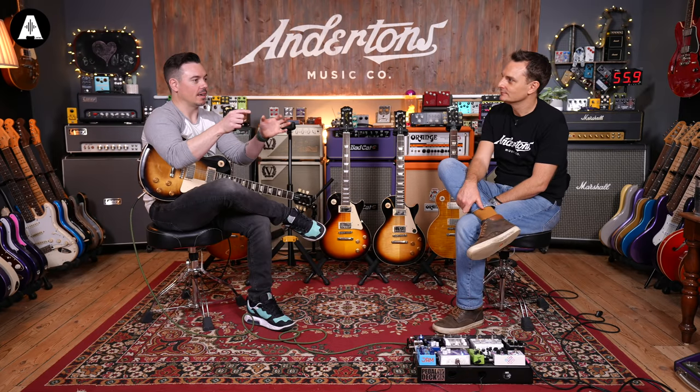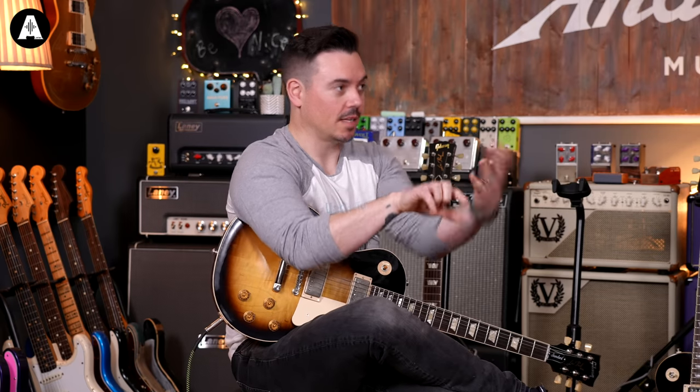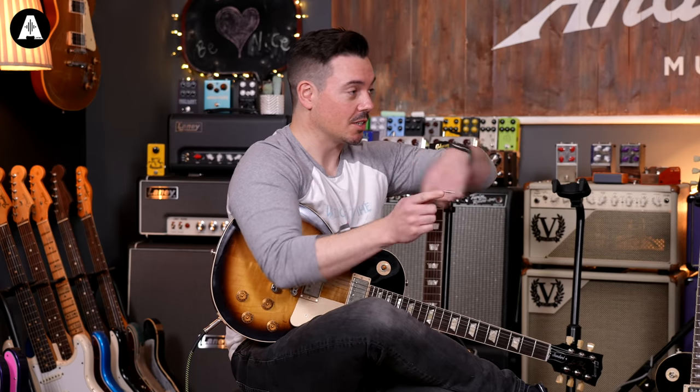So positions two and four on a Strat are reverse wound, reverse polarity. What that's doing is literally flipping phase, so technically from that point of view, it is out of phase. But you also have the magnetic polarity flipped. So if you flip the wind direction, your signal goes from this to the reverse.